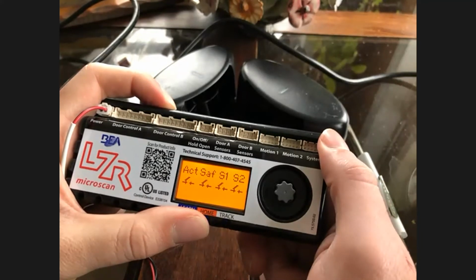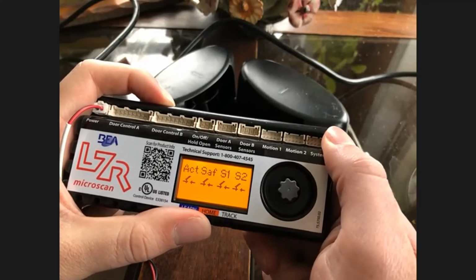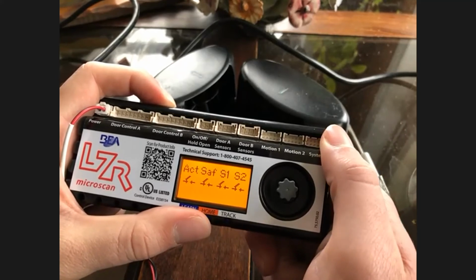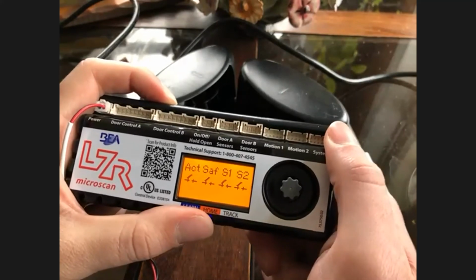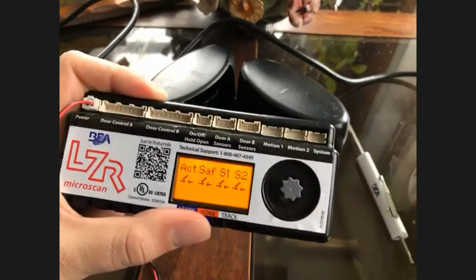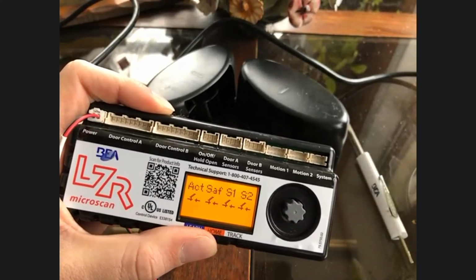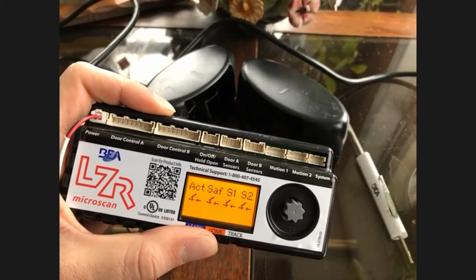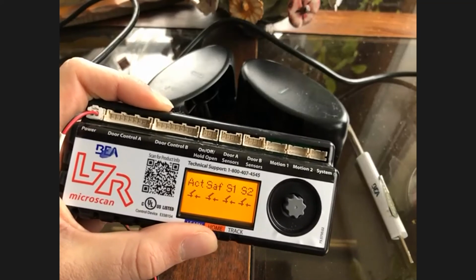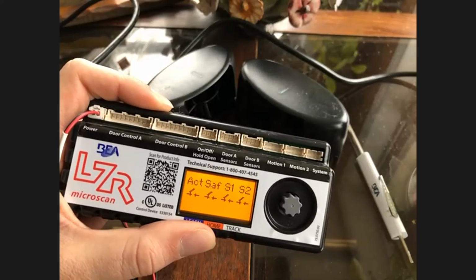One last question. Is the sensor looking at the floor while the door is moving then? Looking at the floor? No, laser time of flight technology has a very specific ability to see a programmed distance. When you do a learn initially, it looks at the ground and retracts by 4 inches. And when you set the door A and door B zone, you're telling it how far to see. That's why you want to subtract it away from the jam or the size of the door.